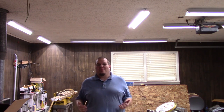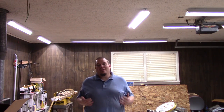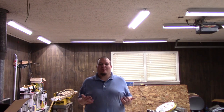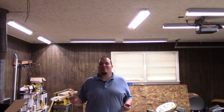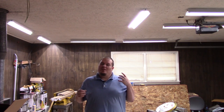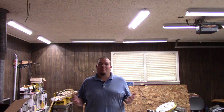I've had questions from people wondering if the LEDs are going to cause flickering when I'm shooting video. That's not really a problem because they feature constant current LED drivers. I only shoot at 30 frames per second, so any flickering would be blurred out by the slower frame rate. Here in the U.S., mains power is at 60 hertz, and if you shoot at 60 frames per second you will see LEDs with cheaper drivers flicker. This also happens with cheaper magnetic-ballasted fluorescent shop lights, but with these LEDs that's just not a problem.